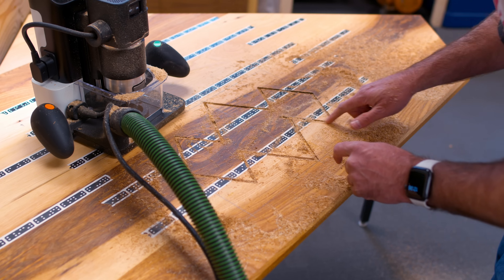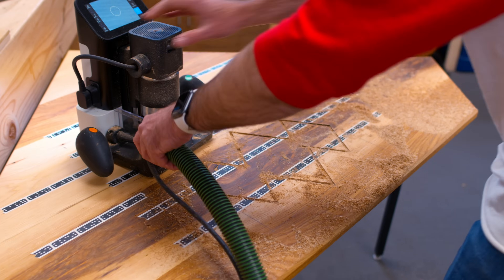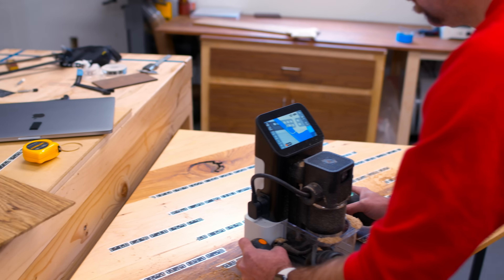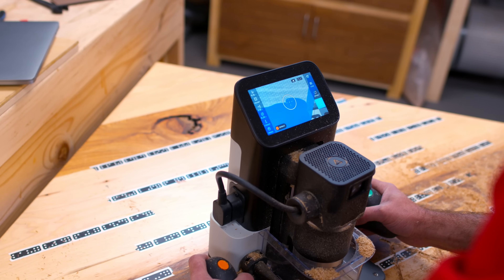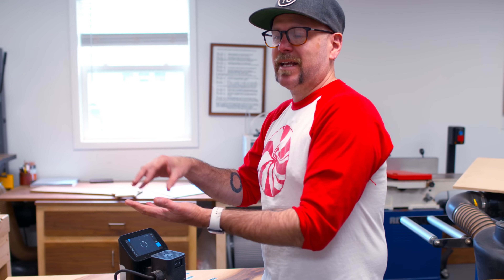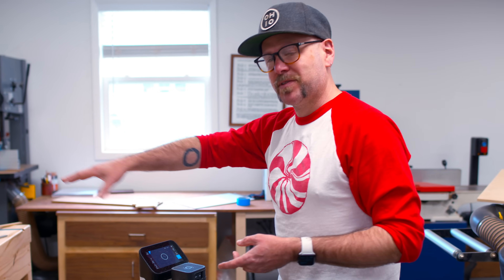I guess it's time to ruin this table. I'm going to go around the outside first, then mow the lawn on the inside. I just went ahead and did the outside and now I've got to go back and forth — that's going to take a while. I think my dust collection was full or clogged up, but that's on me. When you're doing inlays, you want to do the pocket cut and then do an inside-the-line cut. For whatever reason, the pocket cut already insets it a little bit, so I have to do one more pass along the outside with an inside cut.